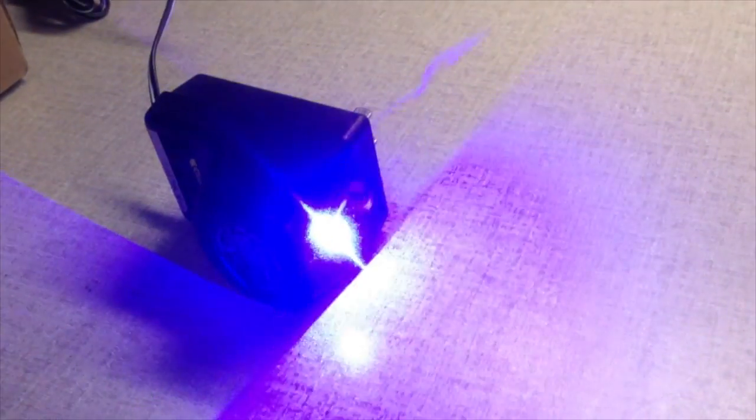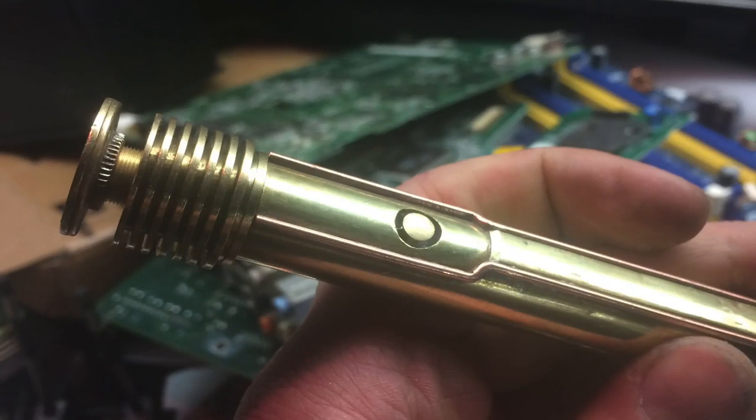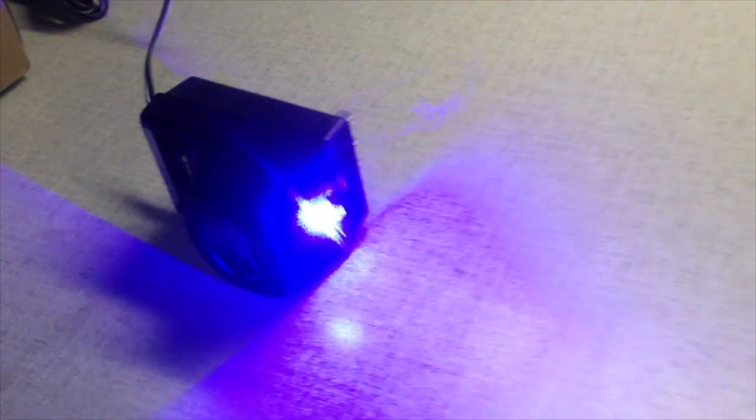Here's some interesting archive footage from a while back. What you're looking at is a 1.5 watt hand-built blue laser, and I've just attached a round solar panel crudely to the front aperture with a rubber band. The phaser sound you're hearing is actually coming from the laser beam, which strikes the solar panel plugged into the line input of a home stereo system and amplified through speakers. The sound comes from changes in the laser beam's intensity due to the laser diode driver being a variable frequency boost mode converter.